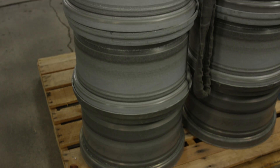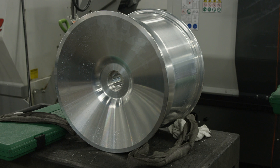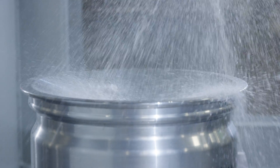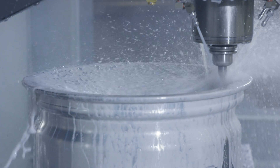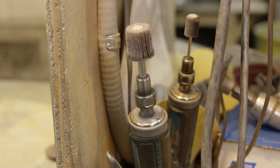Monoblock production is very similar to the three-piece and two-piece, except we start with a solid 110 to 120 pound forging that's kind of in the shape of the wheel. It goes through the lathe the same way — you're going to do the whole entire outside surface of the wheel, inside the barrel, and top of the wheel. It'll go into the mills, which will put all the spokes, the valve hole, the bolt holes, and all that type of stuff in, and then it'll go into the grind department similar to the two-piece and three-piece wheel.